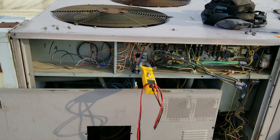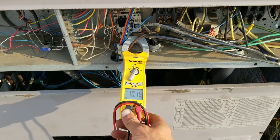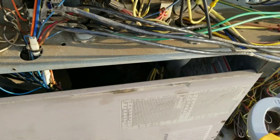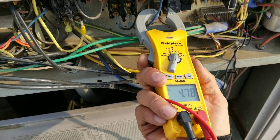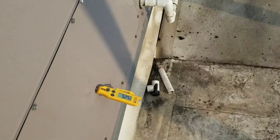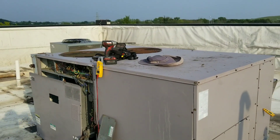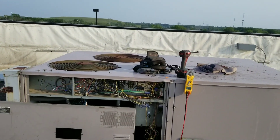Looks like we got kind of lucky tonight — that was our only issue. I went downstairs and turned the thermostat down to 72; the temperature in the office area and stock room was about 74. Compressor amps are pulling about 9.8, indoor blower is pulling 4. Supply temps are at 52 degrees with a 78-degree return — pretty good for a 21-year-old unit. I'll replace that fuse once I get supply temps recorded. That does it for tonight — hope you enjoyed it, like and subscribe, and I'll see you on the next one.